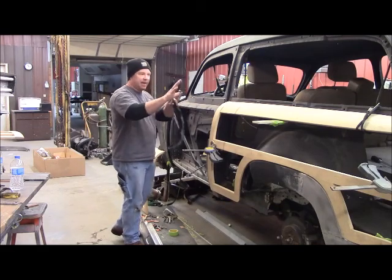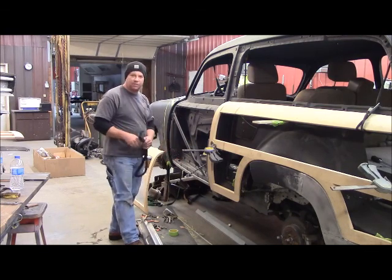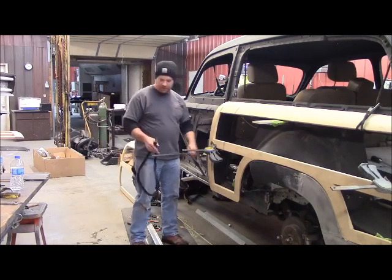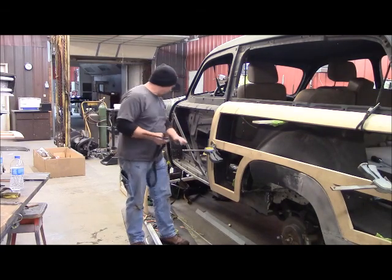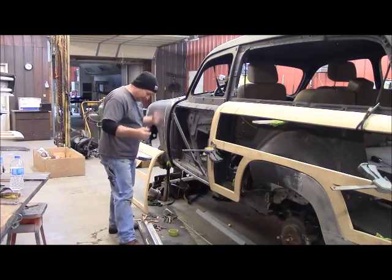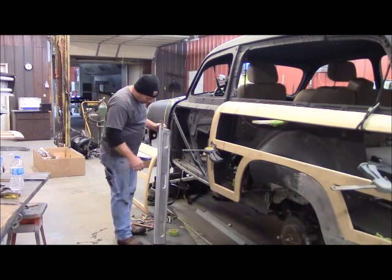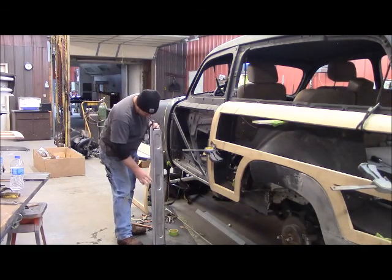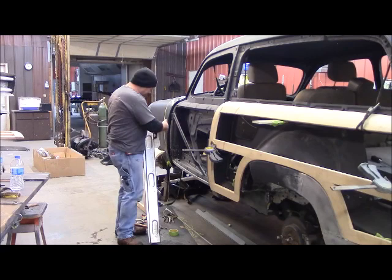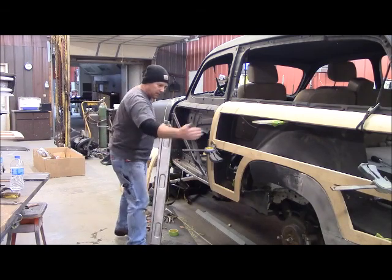Now I've got your wood cut. I know where it's going to be up here in front and rear, and I've got it cut on the bottom in a straight plane. But I don't know the exact location of the bottom of the door in relationship with the door seal yet. I've got your bottom door seal that came with the door seal kit, and luckily it has this and I have the retainer, so I can tack this any place I want. The problem is the rocker — your door has a curve to it and the rocker panel is off a car, the only one we can find, and it's not as much of an arc or radius there. So I'm going to split it all the way down through there, which is just going to give me this radius and this 90. Then I'll be able to shrink this and get the arc I want and start fabricating this up. Once I've got this fabricated, I can get back to doing the wood in this lower part around the front fender.